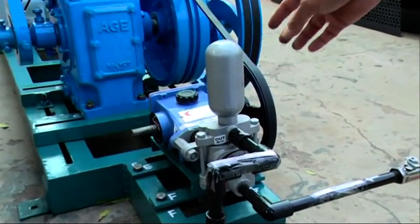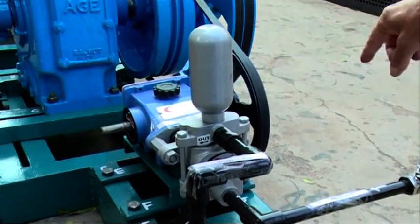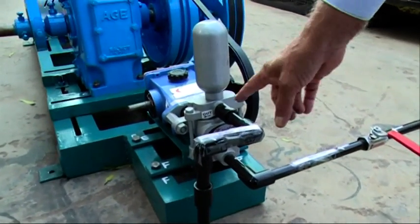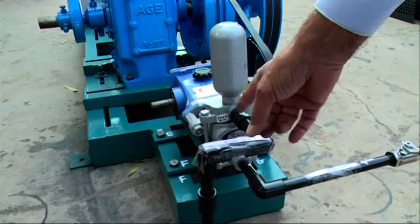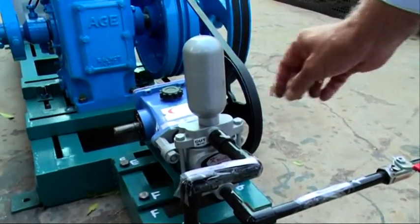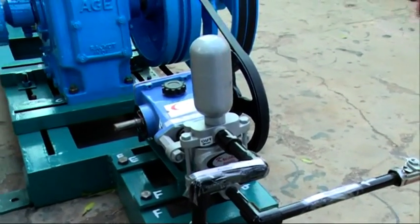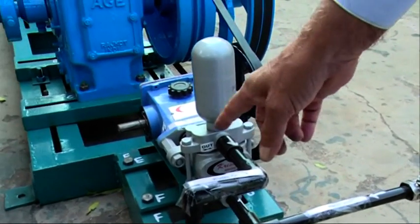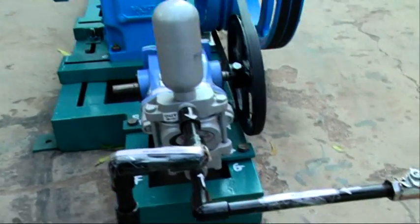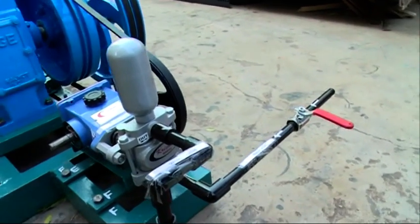In the diagram it will be shown properly, but here the connections were made in haste and they have forgotten to connect the return pipe going to the water tank. Extra water which is not required in the boiler should go back to the water tank.